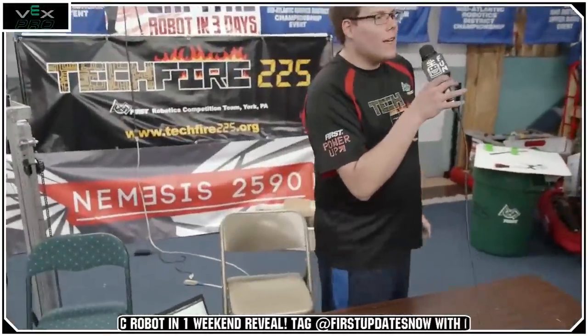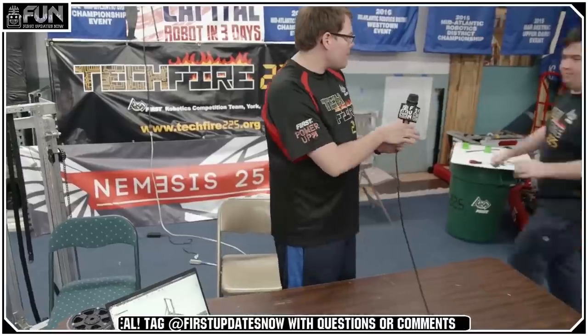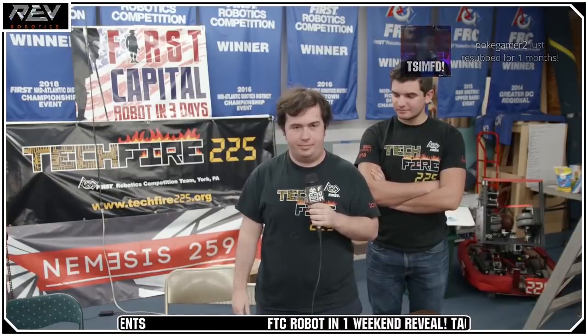Andrew and Adam are going to talk about what we're doing programming-wise right now. We've just been working on framing out a lot of the code since we don't have any hardware yet, but we're trying to get everything in a state where, once everything's together and wired, we can just start tuning controllers. The end goal is doing acceleration-limited motion profiles on all of our actuators — like on the elevator and four-bar. We're also going to try to implement some basic autos, keeping everything copy-and-paste-able so you could tune it on your own robot without much stress.